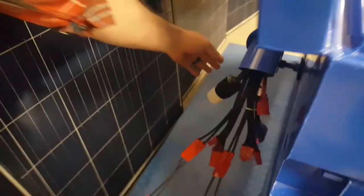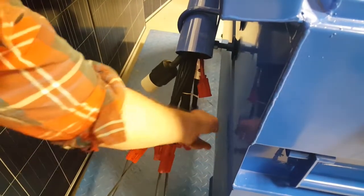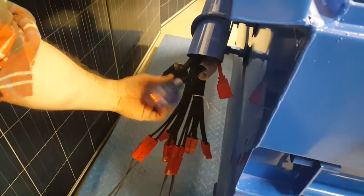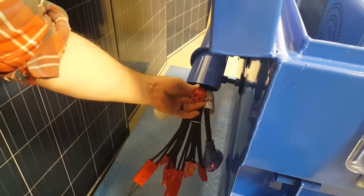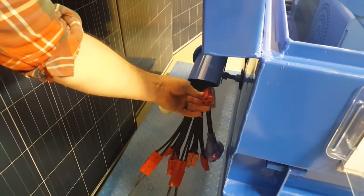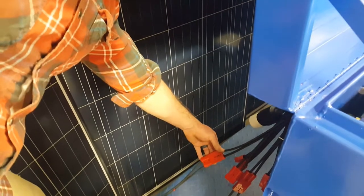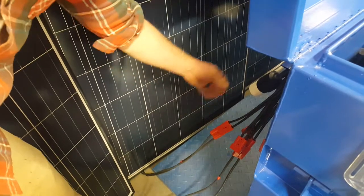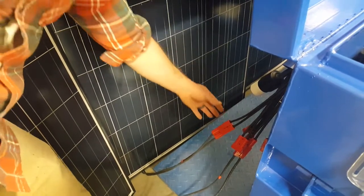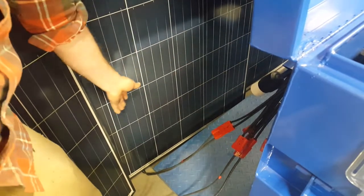Out the back is where you're going to plug in your electronics. You've got your 220, your RV plug right here, and your 110 which you can plug an extension cord into. We're going to include a multi-plug adapter for you as well. These are the quick connects — they're called Anderson connectors. They plug into your panels and are designed to be easier to disconnect than MC4 connectors. These will go back and plug into your panels just like that.